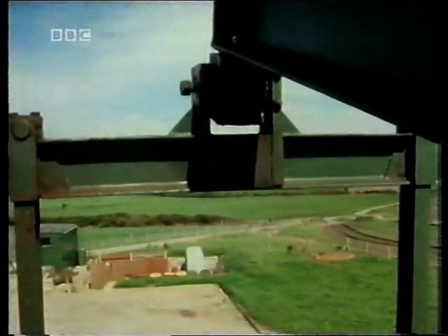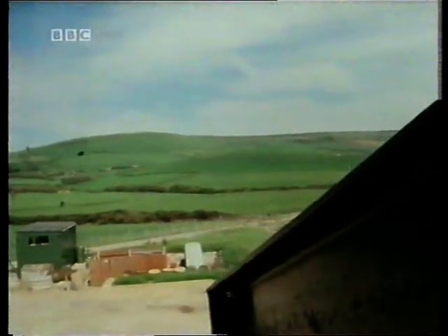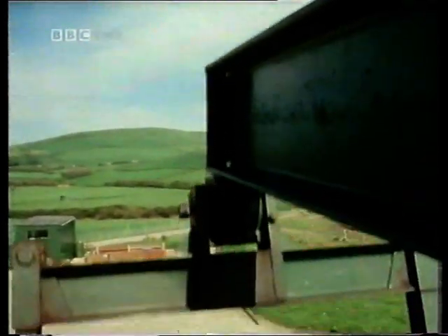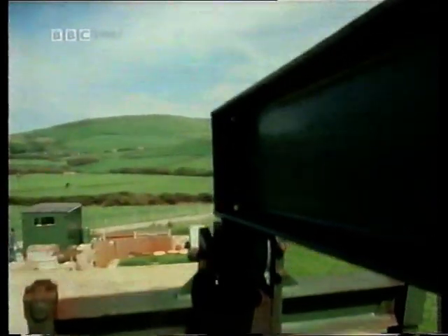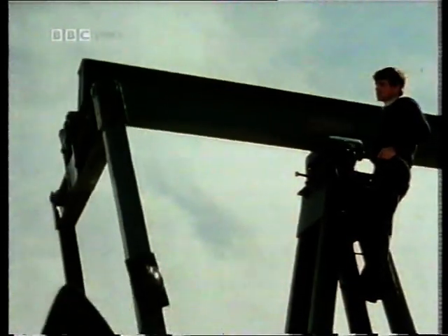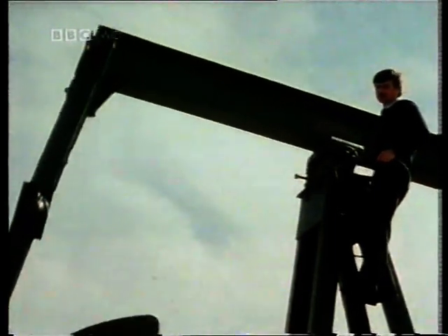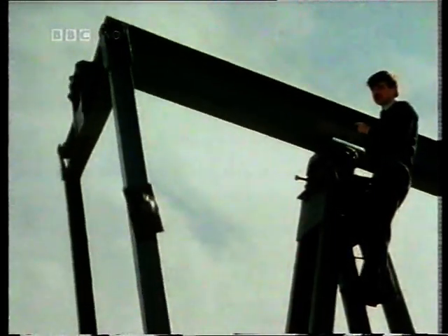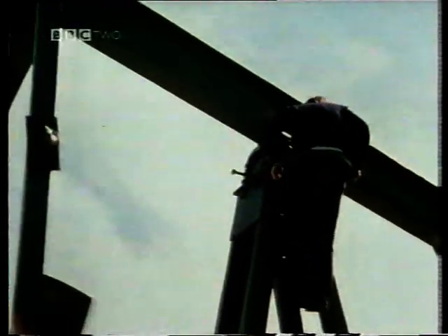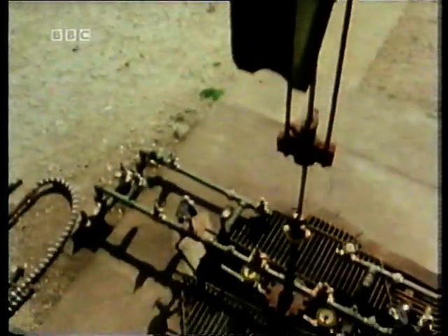There's the rotating pair connection between the coupler link and this overhead link — as you can see, it's just a massive pin joint. The beam itself is in fixed-axis rotation about a fixed pivot at the center, oscillating through an angle of about 40 degrees. And it's the rocking motion of this beam which is transmitted through the donkey's head to give the up and down motion of the pumping rod.